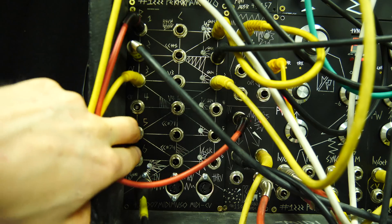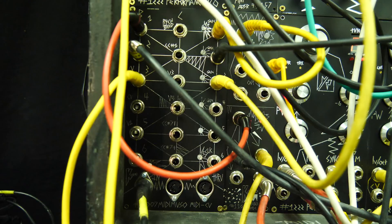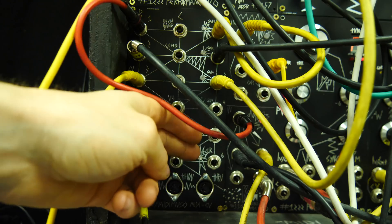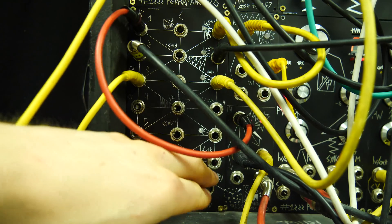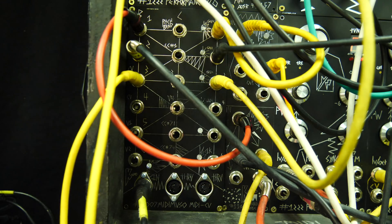You've also got extra voltages. If you assign these to different parameters and send something on MIDI CC71, you can draw a modulation shape on a computer to create crazy modulation. You also have velocities for all channels, though the keyboard used here has no velocity. The clock is here — it runs at 48 steps per bar.